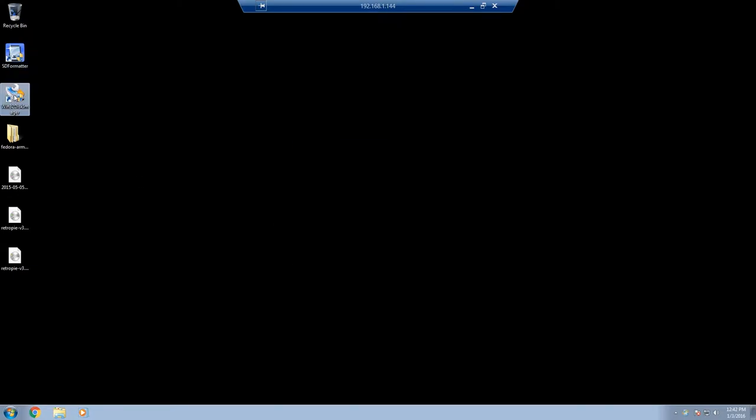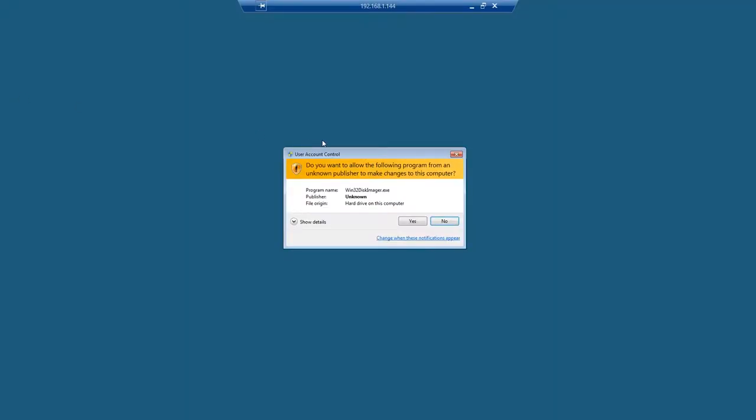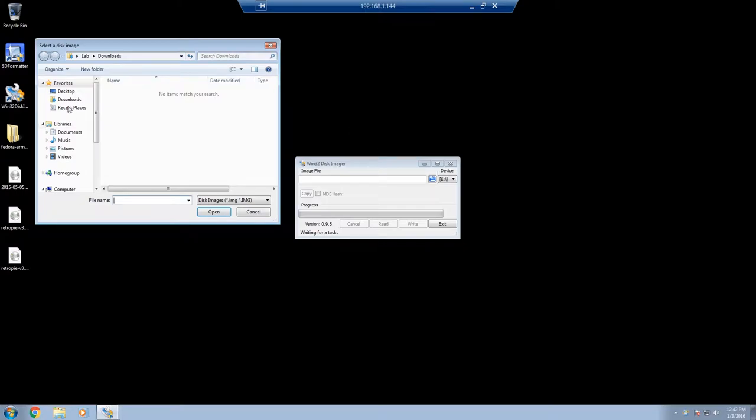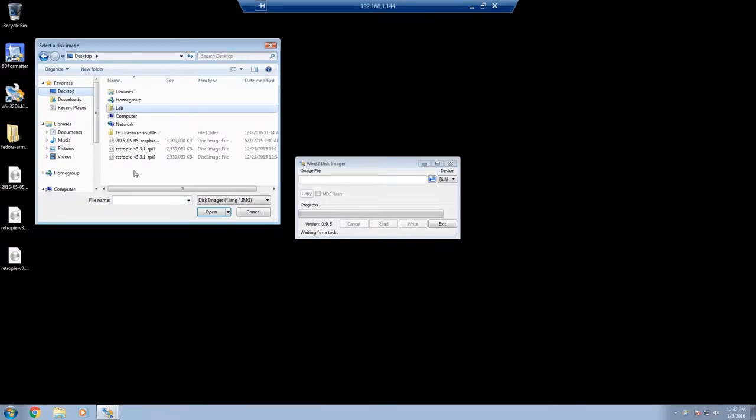Then I'm going to load Win32 Disk Imager to actually write the image to it. Now, something I found a little confusing that I didn't understand at first until I read up was the differences in the two Retropie images, Retropie image 1 and Retropie image 2. I'm going to use the Retropie image 1. It is compatible with the Raspberry Pi 1, B plus, 2B plus. I forget what the 2 is for, but we'll just use this. I'll have this linked in the description as well.